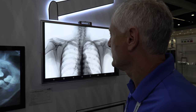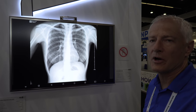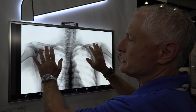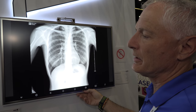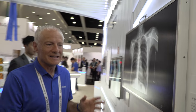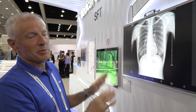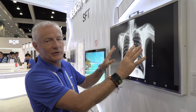This is a new 30 inch display primarily targeted toward radiology. What the radiologists wanted was two X-ray images side by side to do an A/B comparison. The reason that's important is that the way it used to be, a radiologist would have two independent displays — the problem is as they age they shift in color temperature, making A/B comparison very difficult. By displaying both images on the same display, it makes them directly comparable.